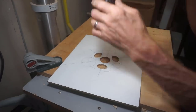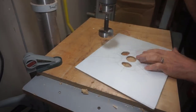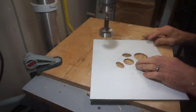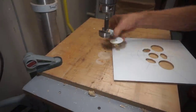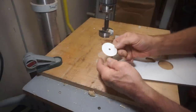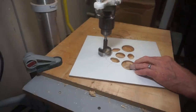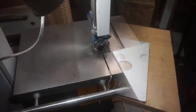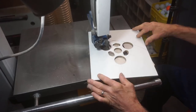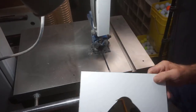The last step for cutting out this template on the drill press is to switch to that large 2-inch diameter drill bit and drill three holes for the caddy's contour notches. Look at that perfect little circle of white melamine that I just cut out — about looks like a melamine potato chip! Once all the holes are drilled, use a coping saw, jigsaw, scroll saw, or bandsaw to cut just proud of the outer size of the template.